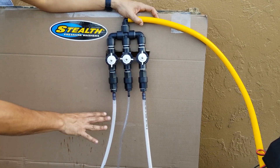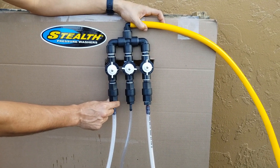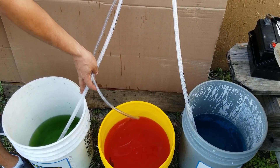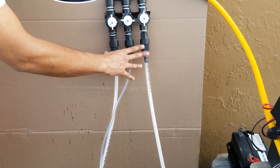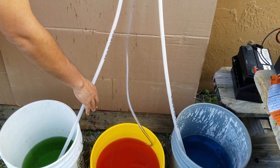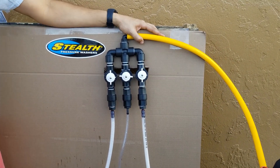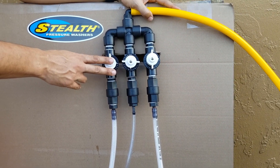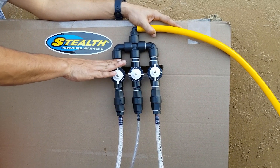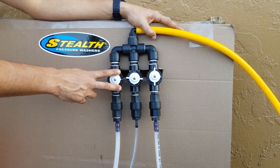When you guys are setting this up, one thing you want to make sure is that you're able to flush your surfactant and your bleach line with clean water. The two ways to do that: either lift your dipstick out of your surfactant and bleach tank and put it into clean water, allowing all three to draw from your clean water tank, or put some three-way ball valves in-line where you switch back to just clean water. Even though these are specially designed check valves and control valves that can handle bleach, specifically made for chlorine and bromide application, you still want to make sure you're flushing them. It's very important — you don't want to leave bleach in the check valve or control valve unnecessarily.